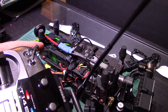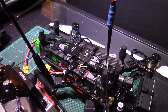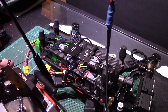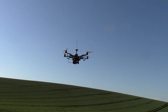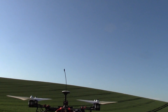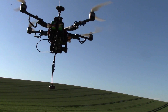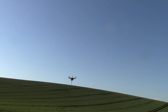I've got it hooked up to switch SH at the back — and there you go. It's a bit tall to be in the shot at the moment, but you'll see it working out in the field. We fly like that with it hanging down, absolutely clear 360-degree line of sight as long as I'm in the air, and when we want to land we flip it up. Out in the field on a fairly windy day, once activated it hangs down nicely. One thing to mention: attenuation from using an extension cable is potentially a problem, but hopefully by getting the antenna underneath the frame it's also reducing interference between the video TX and the Easy UHF system. Fingers crossed — it's a nice cheap solution, continues to be transportable, and thanks for watching.